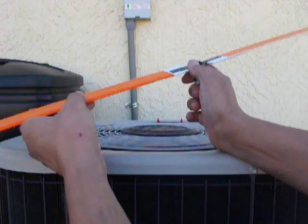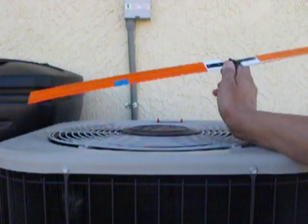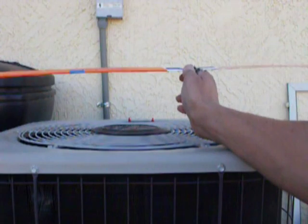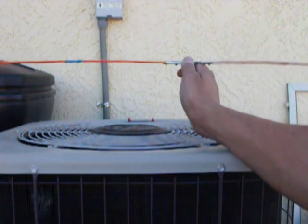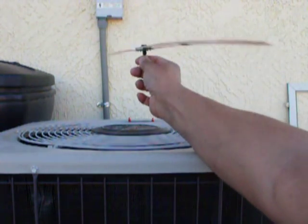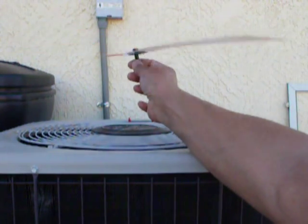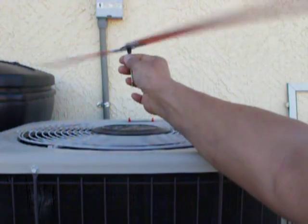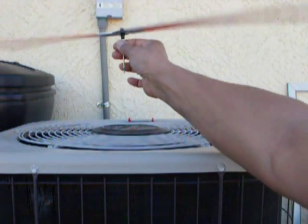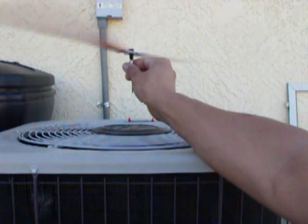The trick is basically in the blade design. This is a blade design which I will later indicate in more detail how I assemble the blade and what makes this particular blade work so well. I don't have to pre-rotate it — just a little mild breeze gets it going. It's very easy to rotate and once you get it rotating it maintains speed, and that's basically what you want in a teetering head or fully articulated design.